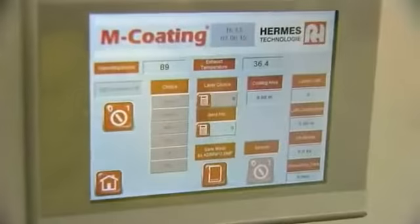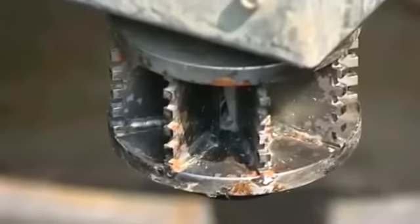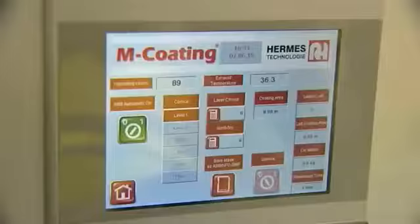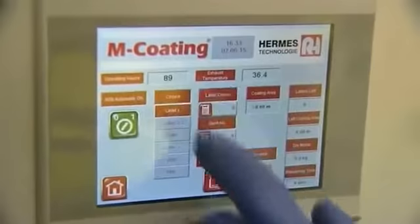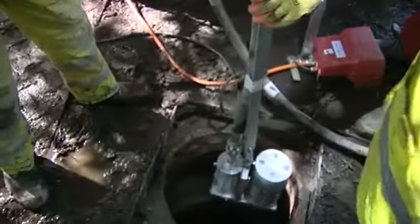This is fully automated and requires no more than a simple change to the setup. This time, a centrifugal spray head will deliver the mortar, moving repeatedly up and down the shaft and spinning at a rate of 5,000 RPM. Once the stop-start points are fed in, the onboard computer makes all of the calculations. On today's job, that's a final coating thickness of 1.5 centimetres.